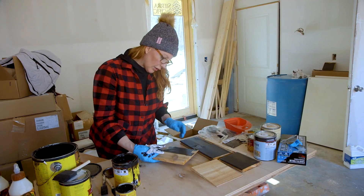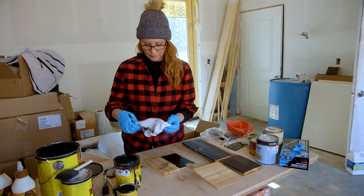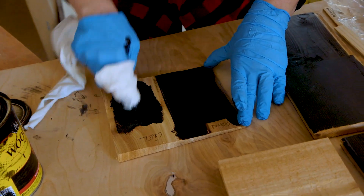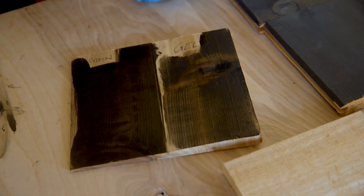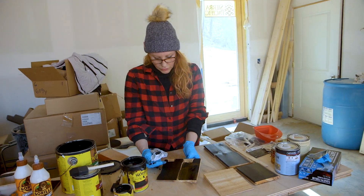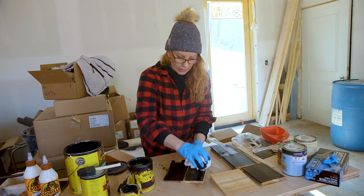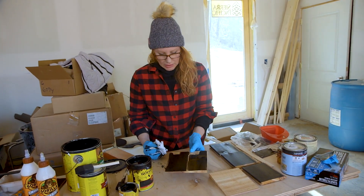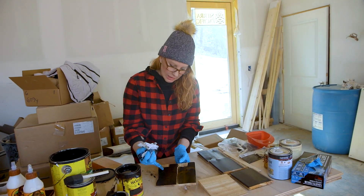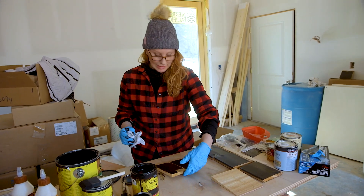That's actually quite beautiful and I don't know how much different it is than the one that I pre-conditioned — so that's good news. The gel stains generally don't have as much pigment; you have to leave them on longer to get a little more color. Definitely got a lot more penetration into the wood from the oil-based, and it's a more intense black leaving it on for the same amount of time. So if that's the color I eventually want to get to, I think the oil-based stain is the way to go. It just means I have to stain everything outside, which is really quite nice because it's lovely out.